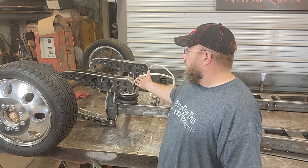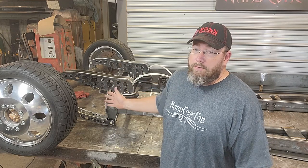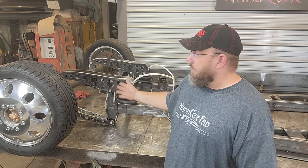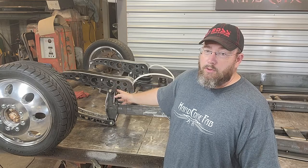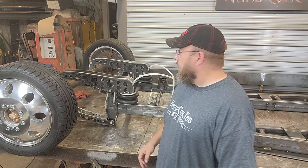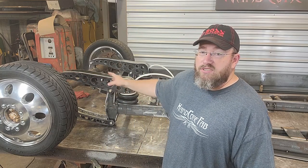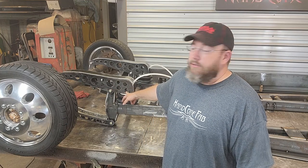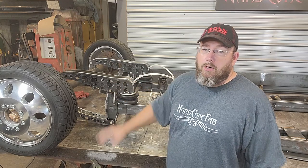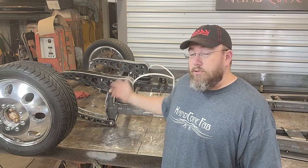I did think of one more question that I get asked quite a bit, and that is, what's the length of the arms and how do you come up with all that measurement? We'd have to go into a whole other video if you want me to explain that, because this one's already getting pretty long. But I will give you the measurements real quick, and then maybe on another video we'll go over how you can figure all that out. This center bolt to the front bolt on this particular set of arms is 17 inches, and then from the center bolt back to the center of the bag we're looking at 5.5 inches. So those are the numbers on this set of arms, which gives you an idea on some of that. So now we can actually put some air to this thing and lift it up.